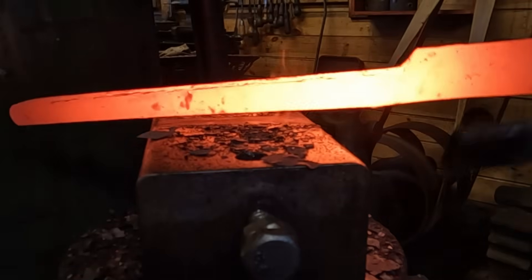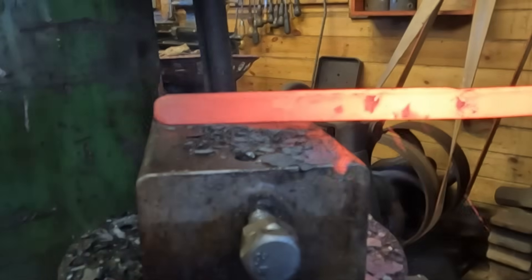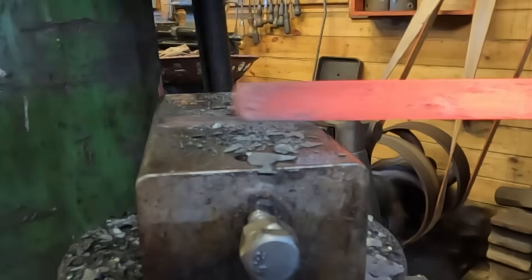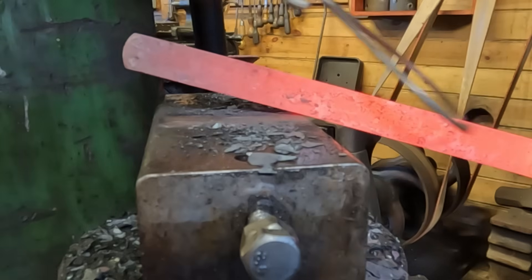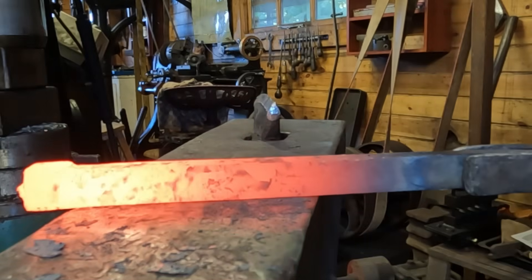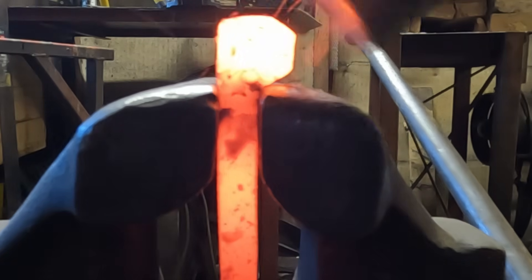The set down by the head is neat and wide and squared up with a set tool, and the body of the key is brought to final size. The key is then cut off the parent bar and the head neatened on the anvil before being upset in place. This further defines the head of the key, squaring up the corners and forging a chamfer on the striking end.